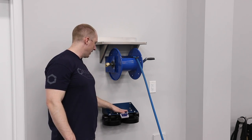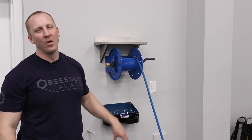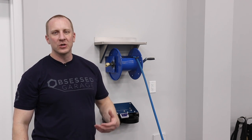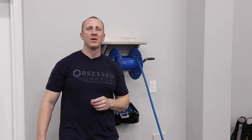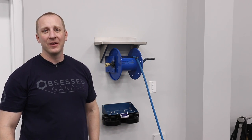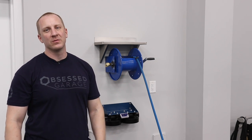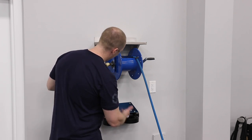We have our CR Spotless DIY 20. I mounted it five inches lower, and my stub is probably going to present a problem — I'll probably have to cut the wall and move the stub downward since this is all going to be hard plumbed. I'm actually going to be using Prevost piping, the same piping used for compressed air, which should work for water. My only concern is running deionized water through aluminum — it'll leach the pipe — but if I spring a leak I'll just replace the pipe every couple of years.